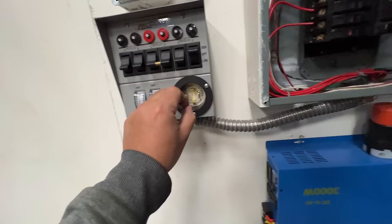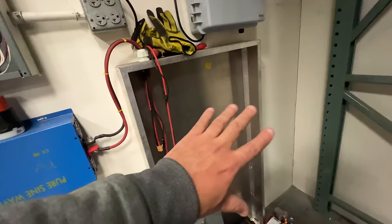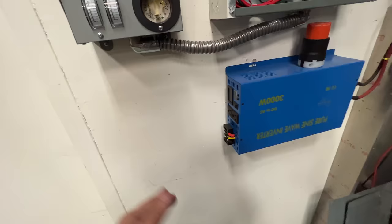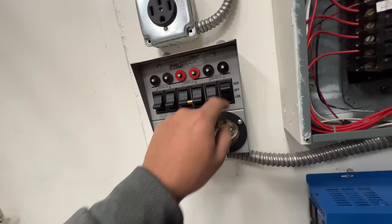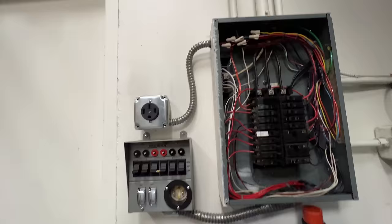The generator would normally be split phase because there are two phases in here. But not necessarily — you could also tie the two hot wires together and just use the neutral. In this case, that's what I'm doing here. This is an inverter that converts DC power stored in the battery to AC. It's a single phase at 110V — half of a split phase — so you connect the two hot wires together. That's okay because it only works that way in generator mode. When it's in line mode, it goes back to whichever leg it's attached to in the panel.